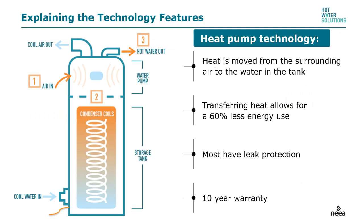How do heat pump water heaters work? Basically, the secret is the vapor compression cycle. You are moving heat from surrounding the tank. The big difference is that you have a compressor — the compressor itself does not make heat energy, it transfers heat energy from one place to another. It runs it through the vapor compression cycle, and because you're moving heat and raising its temperature by compressing the vapor, it is about 60 to 70 percent more efficient than a resistance water heater.